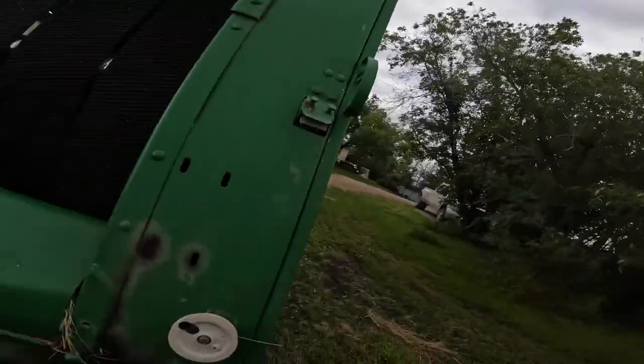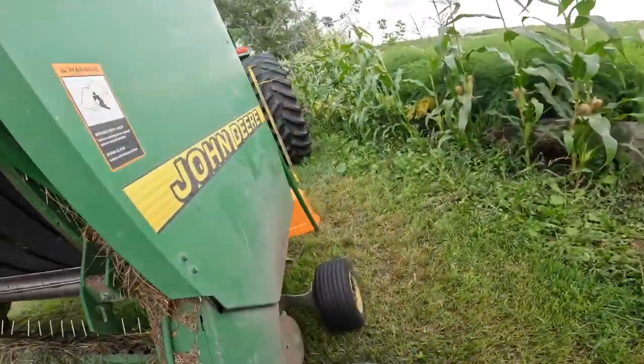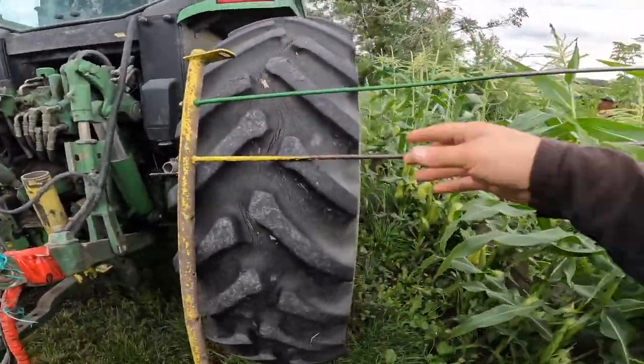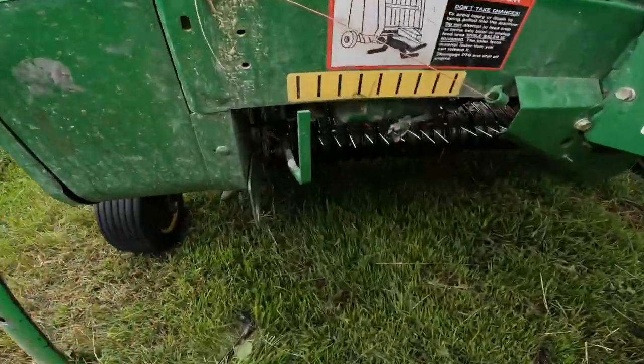I removed all the fingers and got the bales off. Yes, it wrapped around everything — I still have to cut this loose — because I didn't have those compression fingers on. So here I am, switching them out now. I'm going to take the fingers, put them all on here, and then bend them to make sure they're all sitting right. I might have to buy a couple more, but that is what I'm doing here.